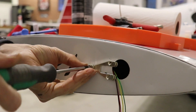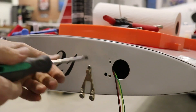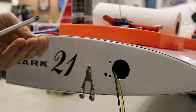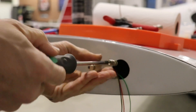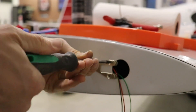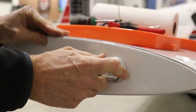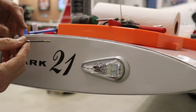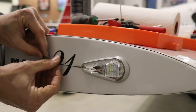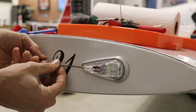Here's that new mounting plate. As you can see, it is designed to fit the three existing holes. So it's just a quick matter of screwing in all three of the countersunk screws and mounting the new plate. With the new plate mounted, you simply put on the light, slide it back until it locks into position. Then there's a little set screw that goes in the back, and that's what holds the light tight to the plate.